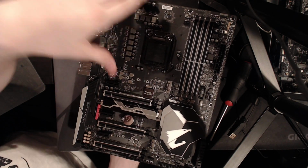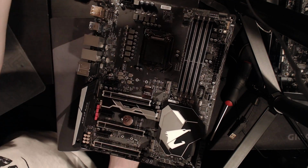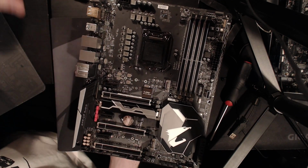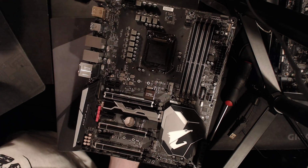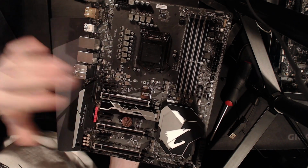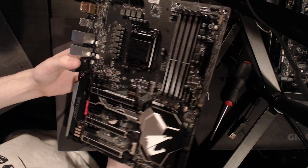They're completely adequate for these power output levels, because they are much smaller. They're not even in their full size package. These aren't great MOSFETs, but the thing is, VCCIO and VCCSA, you're never going to see either of those rails go much above 10 amps. So perfectly adequate there. The voltage controllers, I'm not going to complain about that either.